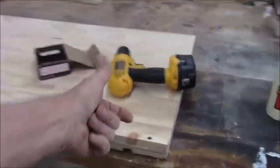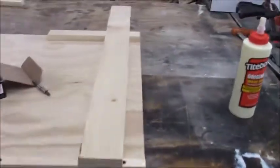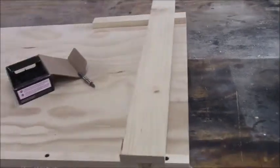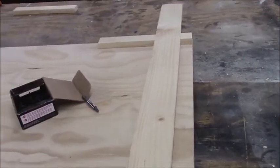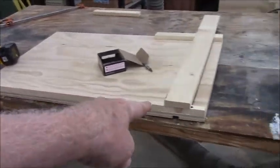Well, I'm going to make a jig, and I've made this for doing siding. It's going to have a straight fence along here. It's going to have basically a bridge that goes across here with a fence on it, so I can slide my door in under this, and then run my skill saw across with the 90-degree angle here and cut it square. As I make more progress, I'll show you, but right now I'm just screwing the first guide of the cleat along here.